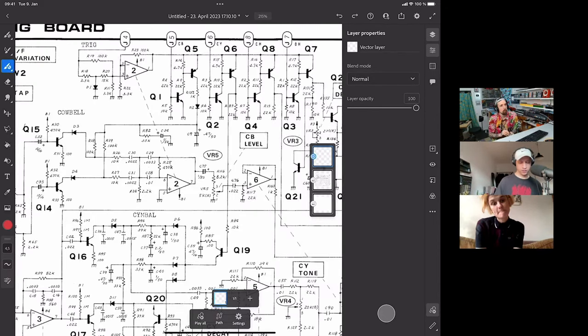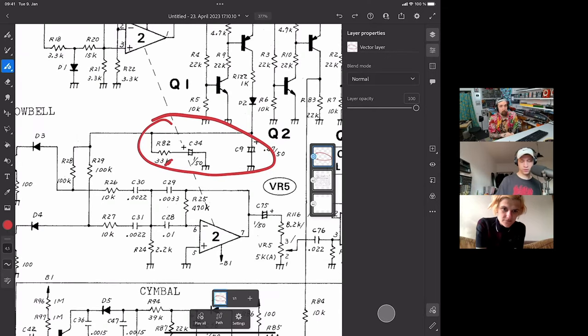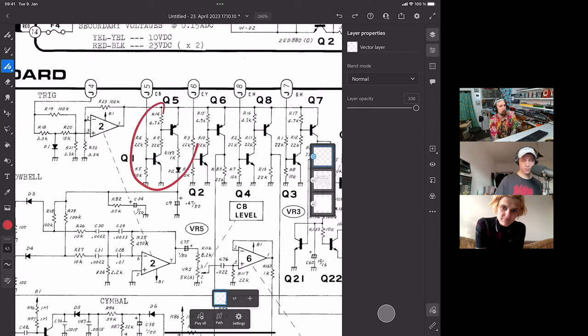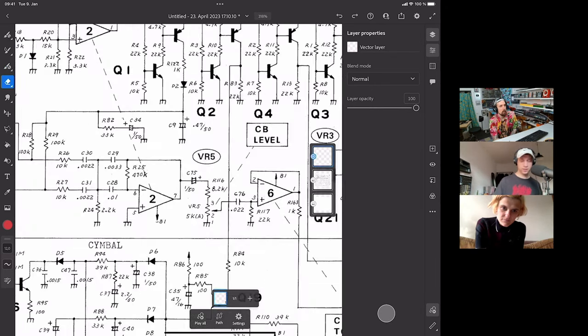And then we set up the envelope generator up here. We played around a little bit with the resistor value to see how it affects the tail. And indeed, if you increase the resistor value, you get more of a ring at the end. This part of the circuit we did not build, because I just replaced it with a push button. If you wanted to trigger it from an external source, you would need something like this, or you could set up a comparator, but that's relatively easy.